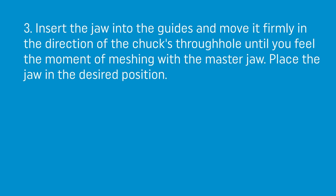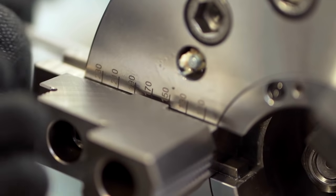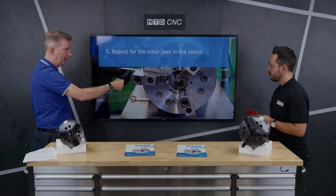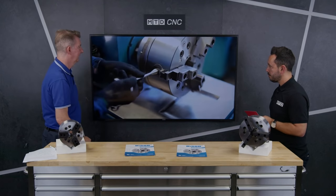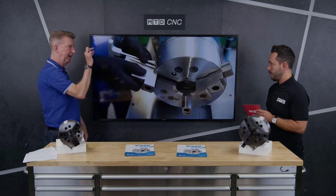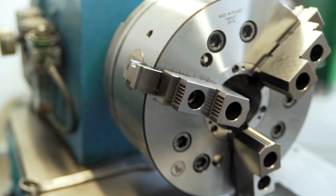With the key, which goes into the special master key, you turn it 90 degrees — there you go. Then you can move the jaws. As a safety feature, when it's in the unlocked position you cannot take the key out, which means the operator cannot start the machine up. As you can see, the key won't come out. For people not familiar with a quick change chuck, the actual master base jaw comes out and is reversible. When you turn the key it depresses, then you put the jaw in; when you turn the key it comes up, locates, and locks in.